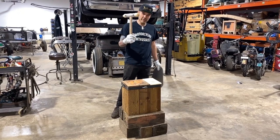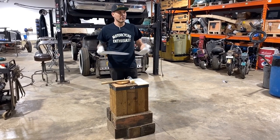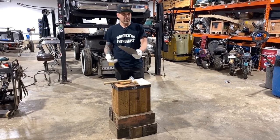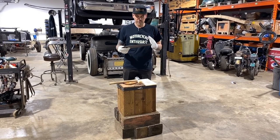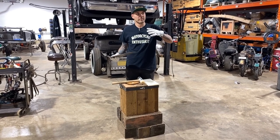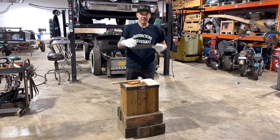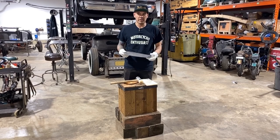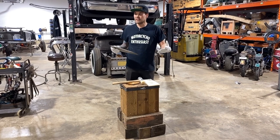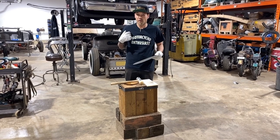With the Mother Tucker and the shrinking stump, the easiest shape to start with is this little teardrop — you could call it a speed blister or the top of a gas tank. My goal is just to show you how simple it is to get these shapes in here. A lot of people have the misconception that making a convex three-dimensional shape is a whole ton of work, and it is and it isn't — a machine makes quicker work of it, but not by as much as you might think.